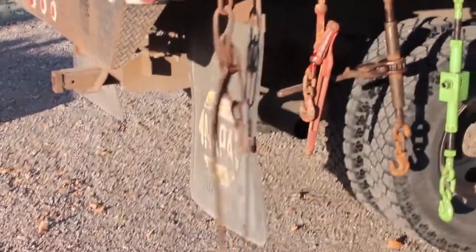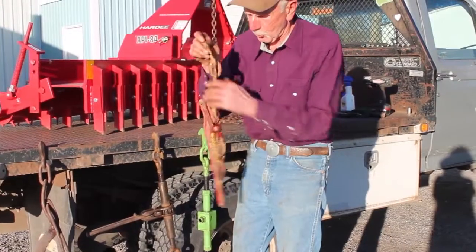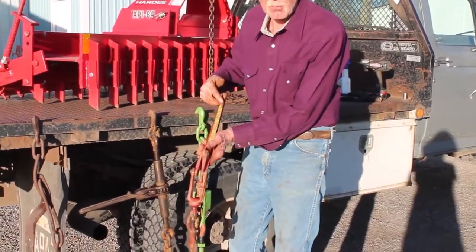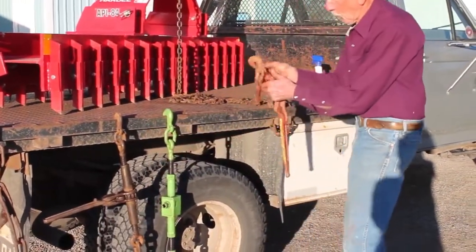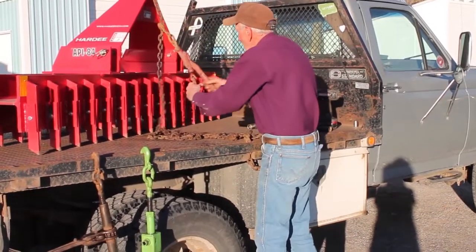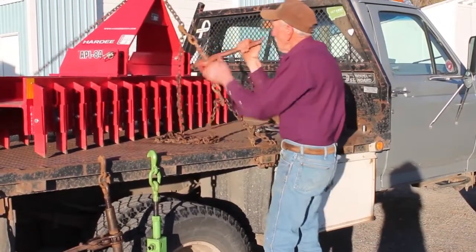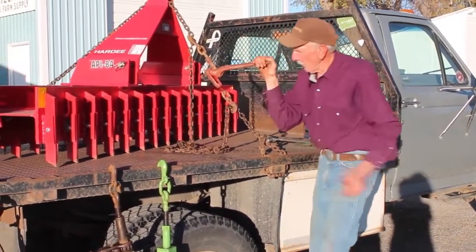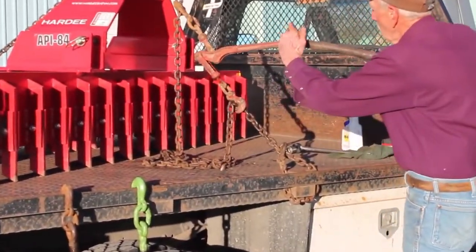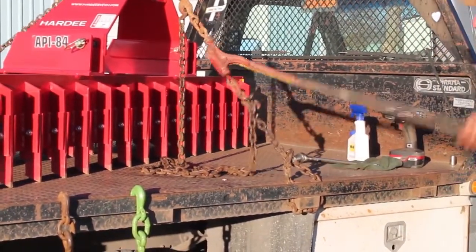The next binder, the best binder that I personally know of, a Liebes binder, extremely good quality. But it says on the handle, do not use handle extender because they're dangerous, as everyone knows. To get that tight, it doesn't have a long handle, so you use, even though you're not supposed to, a cheater bar or a handle extender.